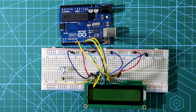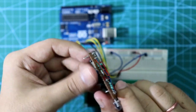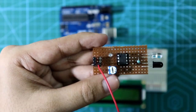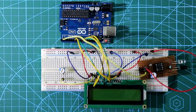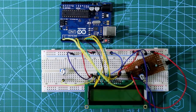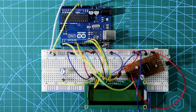Now we'll see the IR sensor connection. In the last video I explained how to make this sensor yourself — the link is in the description below. The last pin is Vout and it is connected to pin number 2 of the Arduino board. The first pin is VCC and the middle pin is ground. The VCC pin connects to the positive rail, the ground pin to the ground rail. We also connect the Arduino's ground pin to the ground rail and the 5 volt pin to the VCC rail. The circuit connection is now complete.